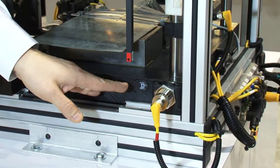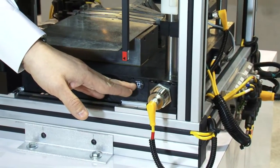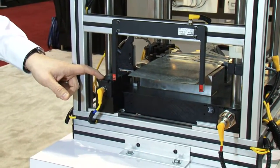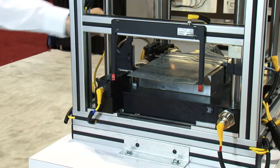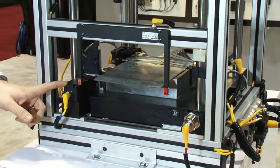You don't have to have a traveler or any paperwork traveling with the die. All of the information is stored right here on the chip and read by the head. Over here we're demonstrating non-contact couplers, which can be used to transfer information across an air gap to the sensors, and then the information from the sensors back across the air gap to the press control.